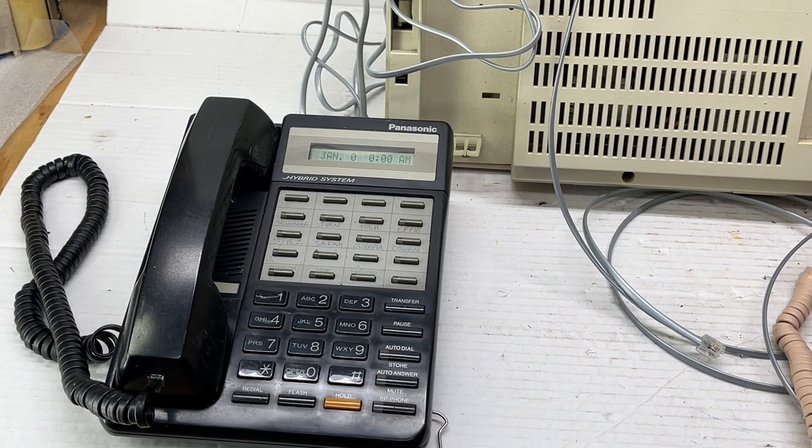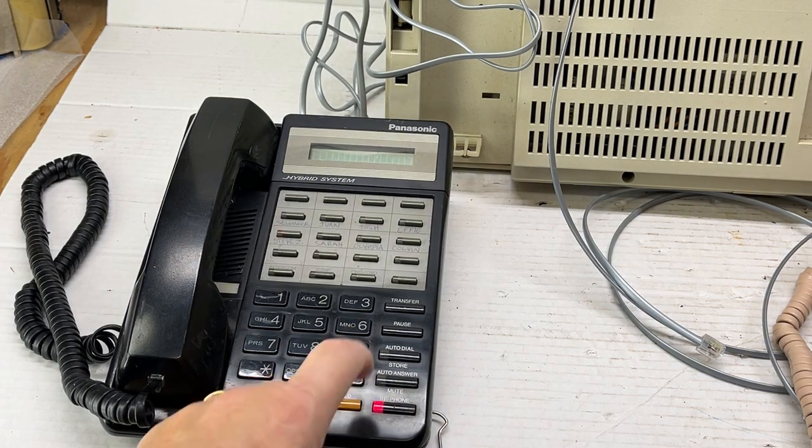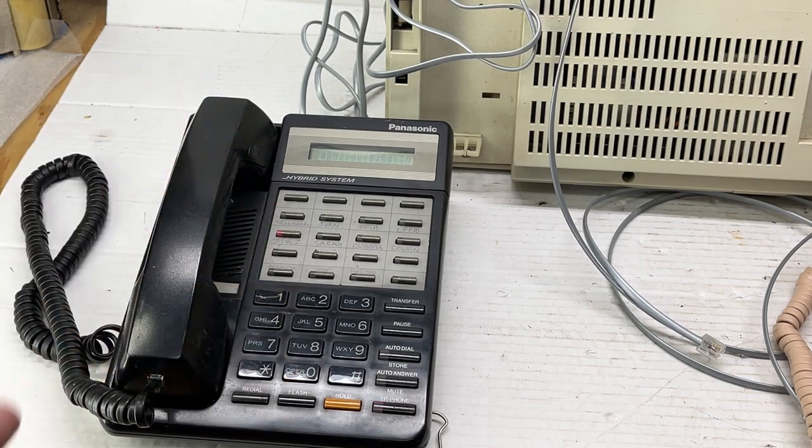The tone you heard — the dial tone — the intercom dial tone is 400 Hertz. I'll go off hook and dial 9, and we have dial tone from my step-by-step system. I could dial different numbers within that system. Or you can press the line key directly and be on the same thing as you would get if you dialed 9.